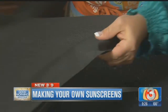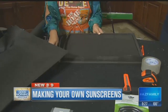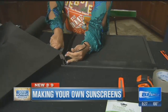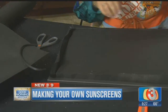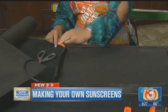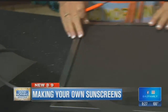Once you get the spline all the way around — just in the interest of time, we've got one all the way done — you're going to cut the edge of your spline right here. It cuts with scissors for a nice finish. Then take your utility knife and just slice off the excess screen edge, being careful not to cut the screen itself. Just slide it along like so and it gives you a nice, finished edge.